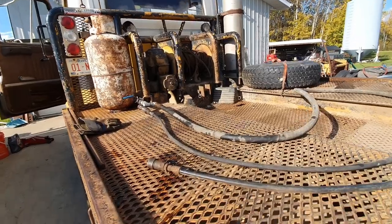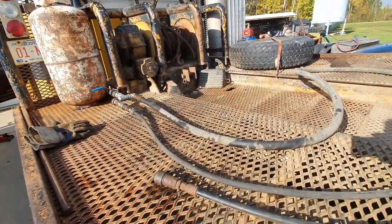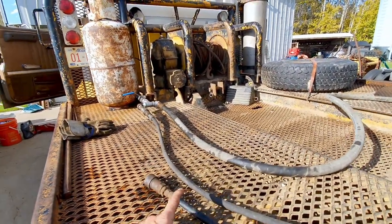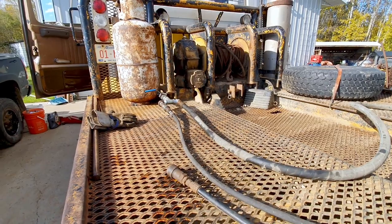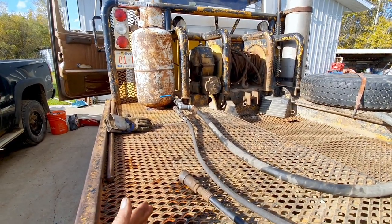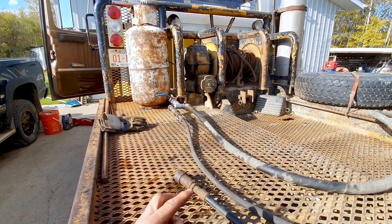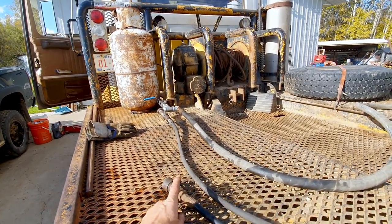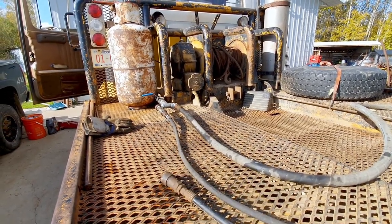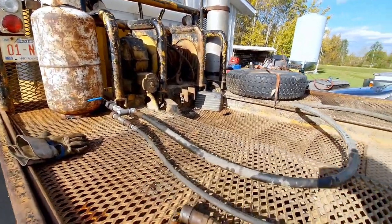This truck has just a little PTO hydraulic pump. It's set up with a hydraulic system for a dual-acting cylinder — like nearly every hydraulic cylinder has a piston side and a rod side, and you hook it up with one and the other and push it up or push it down. But with a gravel pup, it's only single acting.